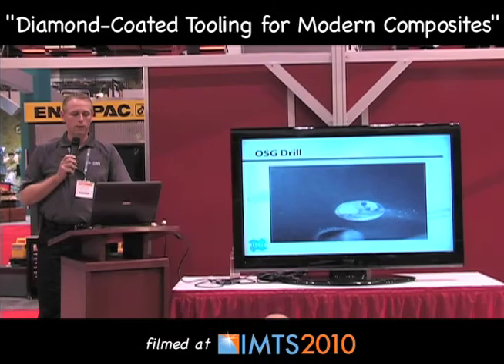Next is a tool that is more effectively cutting this material. You can literally see with the last revolution, on the very end of the laminate, a very clean cut edge. That's the goal — to machine these materials without that type of separation, whether on the entrance side or the exit side. That's a pretty clean cut hole right there, and really what we're striving for.